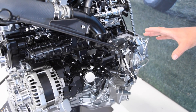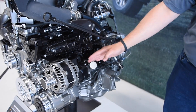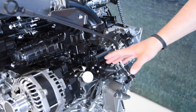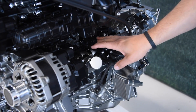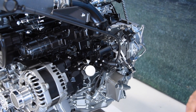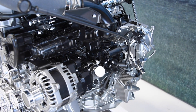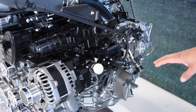Another aspect of the engine that gives us great fuel economy is our active thermal management. This right here is our rotary valve — a new system on our diesel engine this year. The rotary valve is essentially a very high-tech thermostat. It allows us to control the flow — to control where the warm liquid goes and how we cool and heat things differently. We use it differently during cold startup than when the engine is hot.